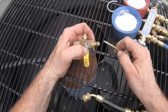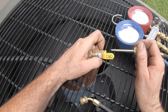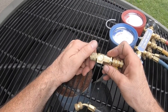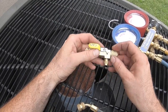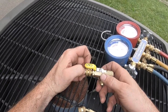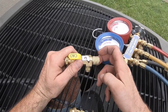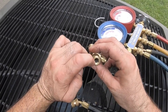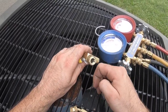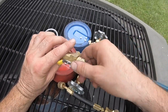It is the BVCRT Schrader core removal tool. In the air conditioning world, Schrader valves — or Schrader cores, whatever you want to call them — they leak, as you can see in my video. Besides leaking from wear and tear and people putting their gauges on and off, sometimes people over-torch the valves, and when they do that, unfortunately the Schrader pin's little gasket cooks off. You have two different O-rings inside: the outer one gets it on and the inner one actually makes the seal against the flare, just like a hollow valve for an air conditioner, making a seal right up against it.